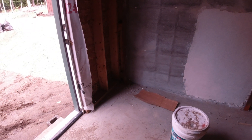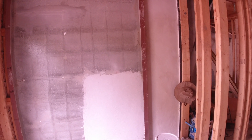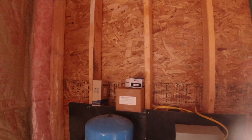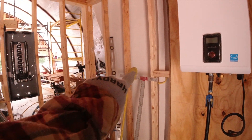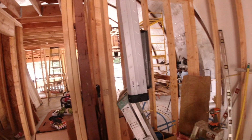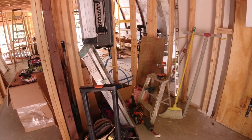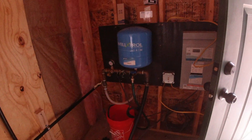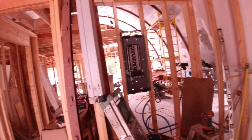I'm cleaning up in here because I am going to paint this utility room wall — the laundry side — with dry lock. We're no longer going to quikwall it because we are now going to insulate it, since the house is not going to be covered with dirt. It really doesn't have much R-value for the winter. We're going to finish insulating this wall over here, and insulate over here too. We're basically going to try to protect all of the utilities in here from getting too cold. Even our lithium iron phosphate batteries for the solar system can't get cold when they go in here. We definitely don't want any of our pipes to freeze. That just means we now have a change in plans.